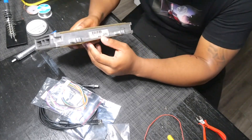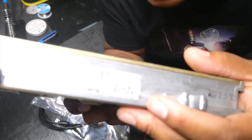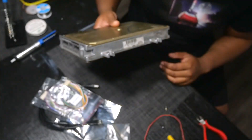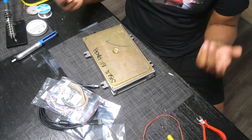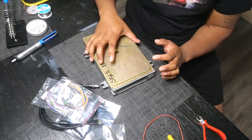One thing I forgot to mention — this is an automatic ECU. The way you know is the second to last number in your serial number. The A51: the five means automatic and I believe the one means manual. So I'm gonna go ahead and convert this to manual. I'm not 100% sure if that's necessary if you use Hondata, but I'm just gonna do it anyway since I have it all apart. I need to take it apart first, so let's go ahead and do that.